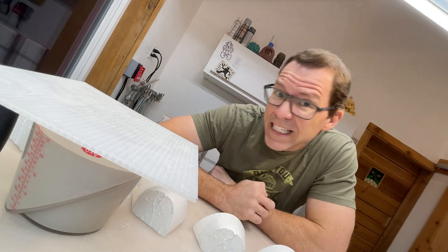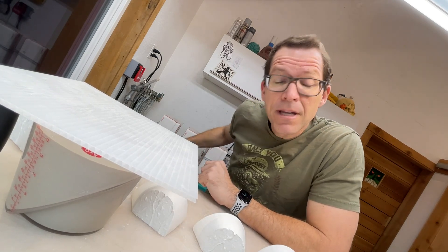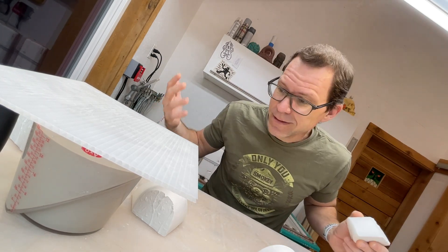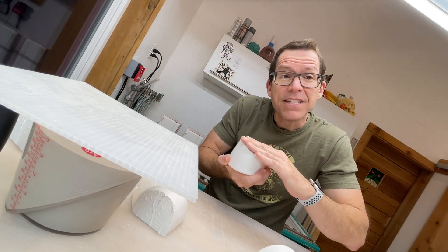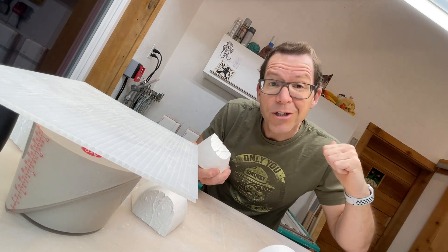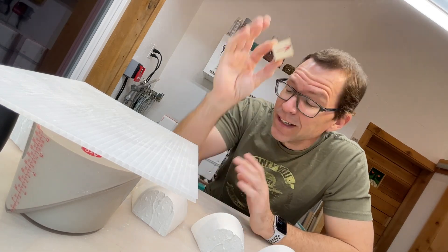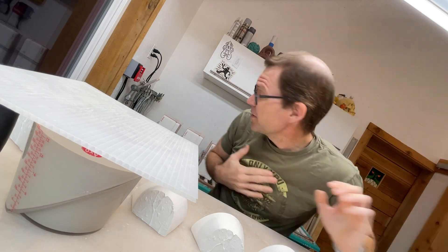Third and biggest — this mold is a little tricky because, just like the puka pounder, we are going to erase the pouring gate. That thing I poured the slip through on top is not the opening in the mug — it's actually the top of the mug's head. After dwelling, we're going to drain it, clean out that hole, take a syringe to put some more slip back in, put a plug in, flip it over, and let that opening seal over. It's complex. And to make things crazier, this has to sit at a special angle in the mold so the slip will be even on top. I've cut some special boards for this — lots of experiments.